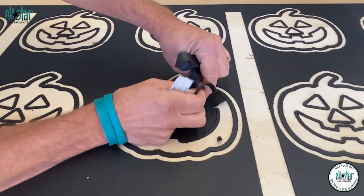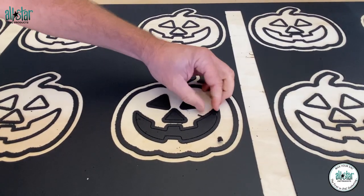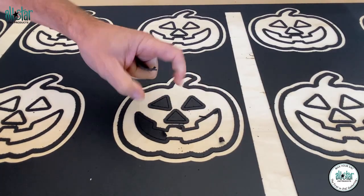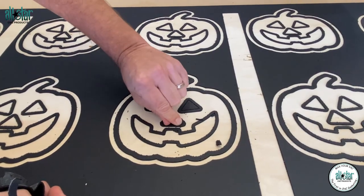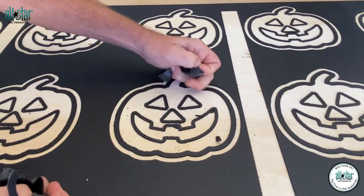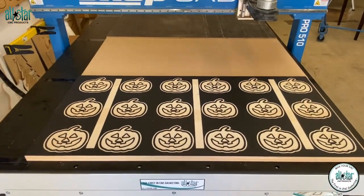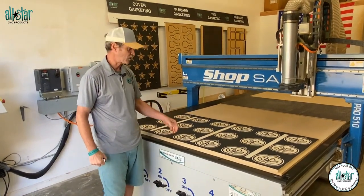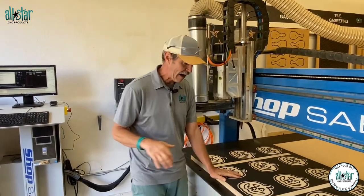The next line is for the vacuum cavity area — we've got this ready for the pumpkins, bringing it out to the very edge of the part, even if there's a narrow piece by the edge. Because the eyes and mouth are going to be through-holes, we want to account for that and leave a gasket wall, so as we cut through the part we're not compromising our vacuum chamber area. We left a quarter-inch wall — you can always adjust that depending on the size of your part.